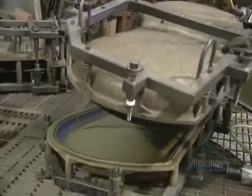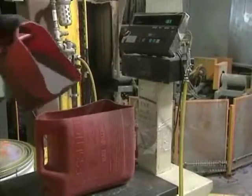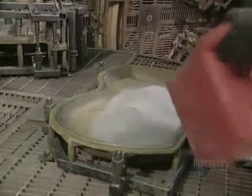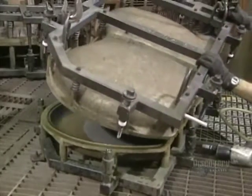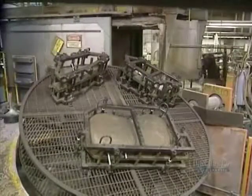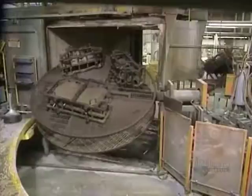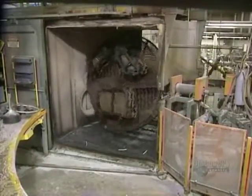There's another way to mold plastic: by rotation. This previously colored powder has a 35 mesh size, which is just a little larger than flour. Low-density linear polyethylene is poured into the bottom of the mold. The mold has a cover which is well closed, then placed on a steel support. This support is articulated by an arm on two rotation axes simultaneously, allowing the plastic powder to distribute itself thoroughly throughout the mold.